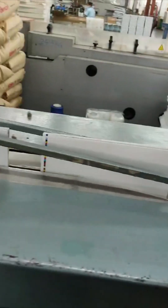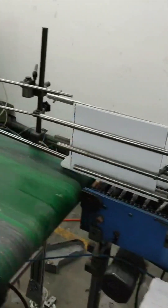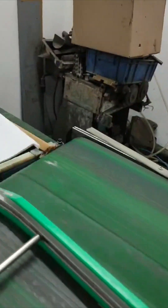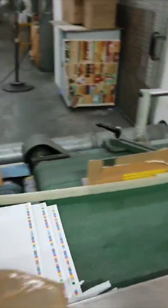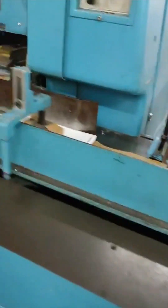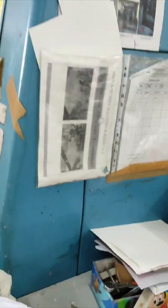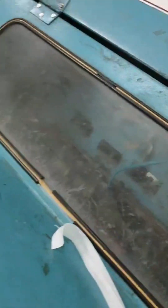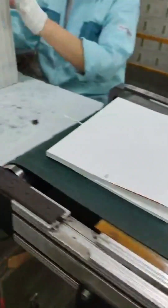This woman is feeding these groups of pages — each of these is the interior of the book — into this long machine that goes down this conveyor belt, falls over, turns a corner. It's amazing how many machines it takes to make one book. And then this pushes it down another corner. And this is a guillotine — these big blades are coming down and cutting off the edge of the book and trimming it so that it is exactly the right size and shape, with all those extra little bits of paper off the edge, so that the art goes all the way to the edge of the book. They trim off all that excess so this is a perfectly square block of paper.